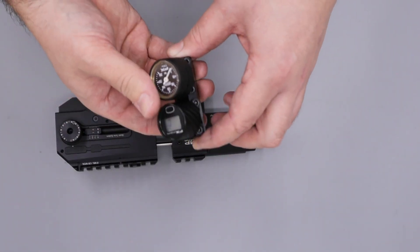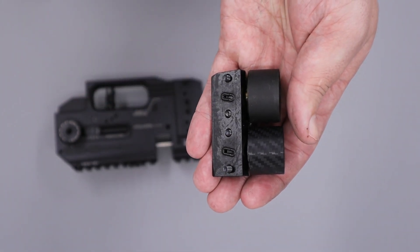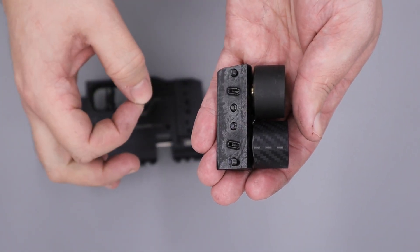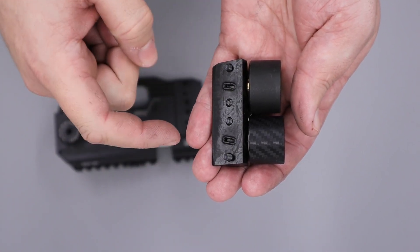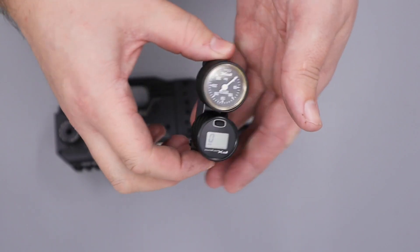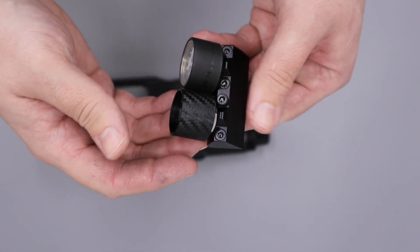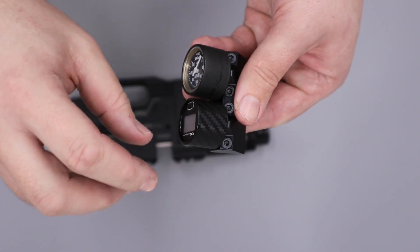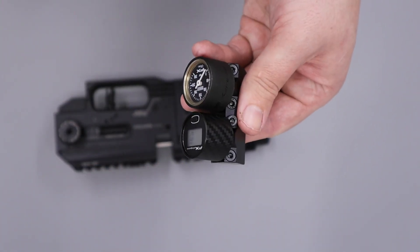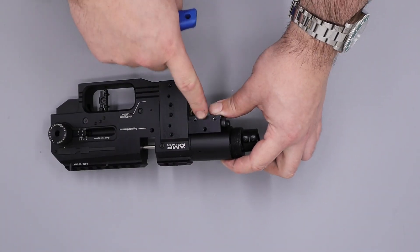As you take this off just make sure the two o-rings — one here and one here — don't get lost. They are standard round o-rings although they're conformed into a slot to make them sort of this oblong shape. We could remove the gauges if we wanted to by simply removing the gauge covers, getting a spanner across the flats and loosening the gauge but we'll leave them on as they are. Next thing we'll do is remove this front block and the plenum.